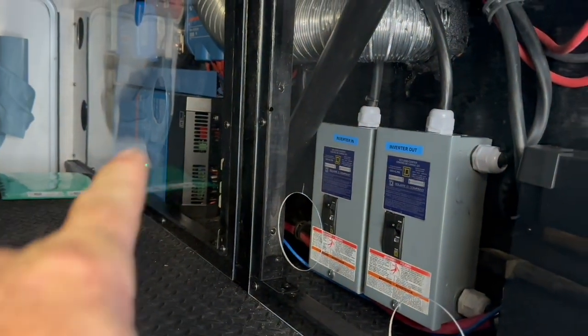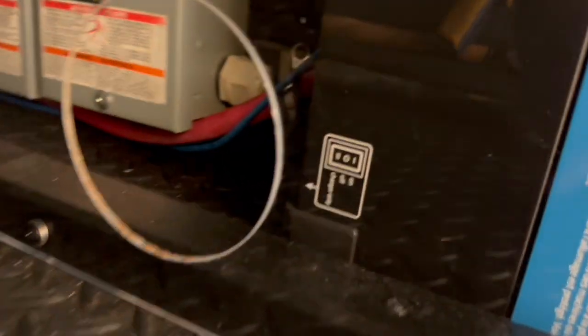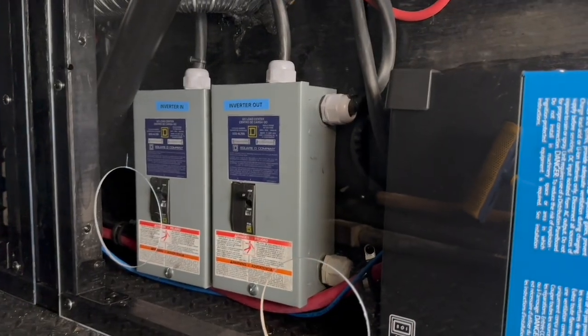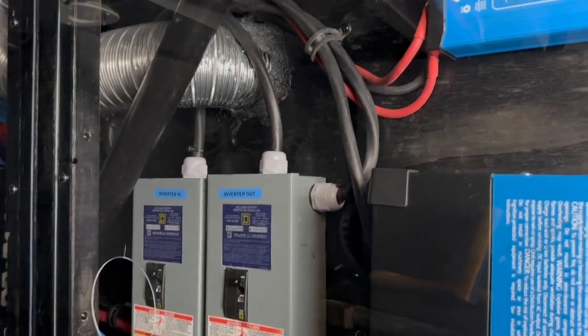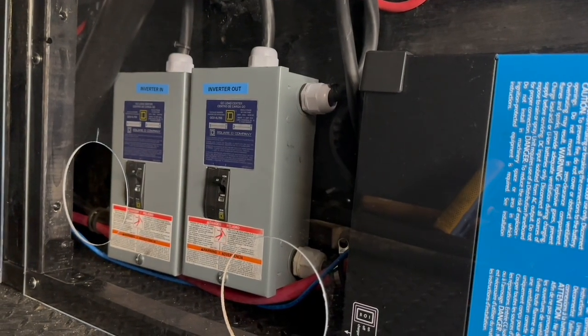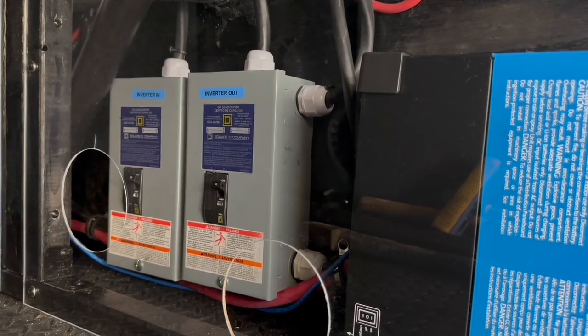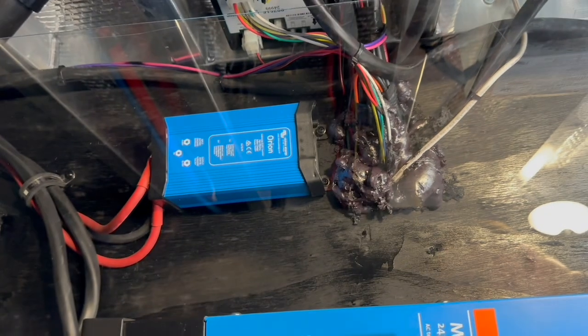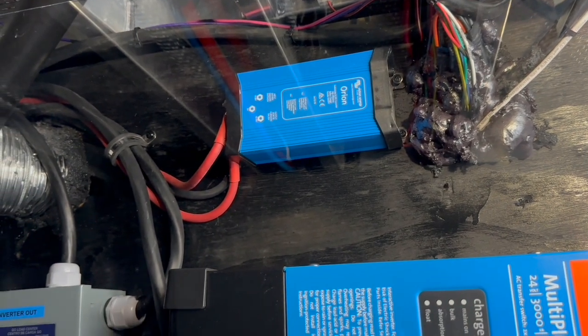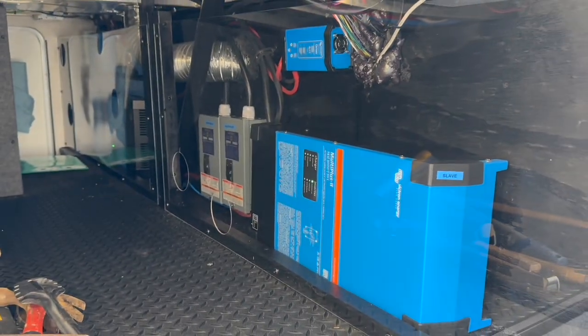On the other side we've got our slave inverter, with a Cat6 cable connecting it over to the master. We have our inverter-in and inverter-out breakers taking the 50-amp cable in from the transfer switch and splitting it between each inverter. These are both 2x120 inverters put into parallel, so we've got all four wires going in and out of both inverters — instead of just 2400 watts per leg in split-phase, it's now a full 4800 watts on either leg one or leg two when inverting. Up top we've got our 70-amp Orion DC-to-DC charger, and we left that one Battle Born 12-volt in there to give him a little extra amperage capacity. Super clean install, saved him all the space.